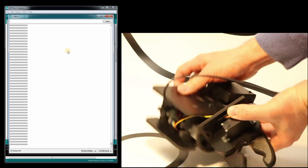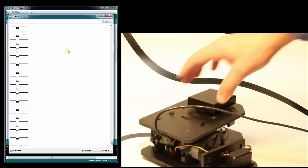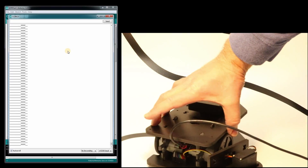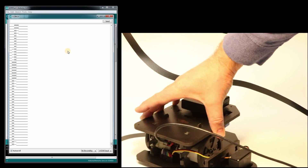You can also see — we put this down on the line course. It has underscores for where it's over the white course, and X's where the line is. Again, right to left, this is the right of the robot, so it sees the line on the right, now it sees it on the left. We know it's working, and we can go on to line following.